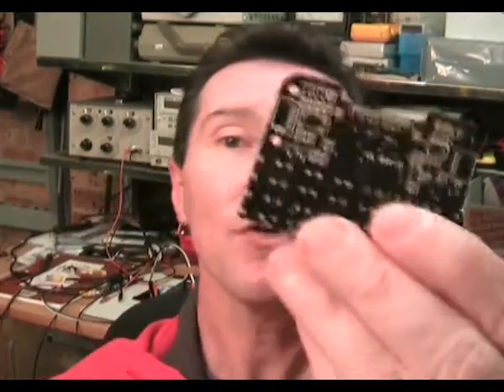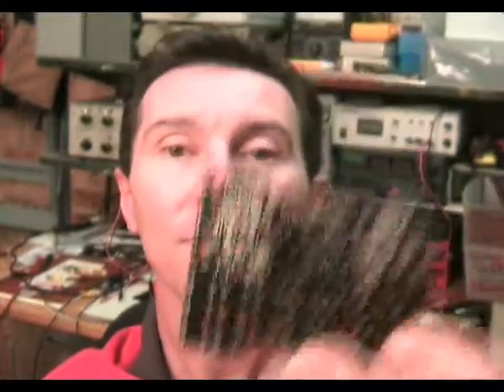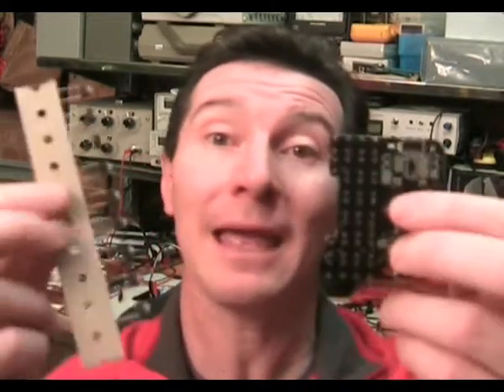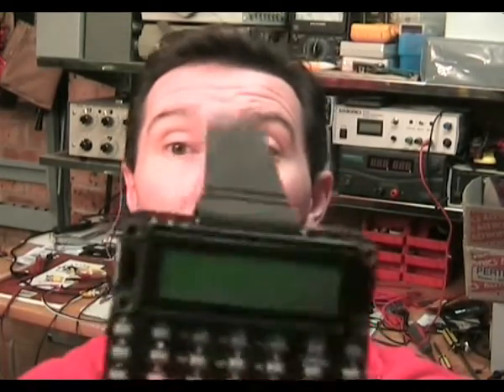I changed the board to through-hole. This one uses the through-hole switches, and that means you can actually hand-assemble these. You put them on, and the holes in the board line up the switches for you. So you can do a hand-solder job and really get a nice professional finish with nicely spaced keys, and it all works really well.